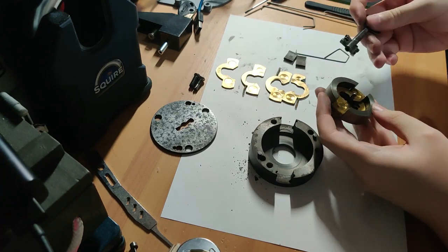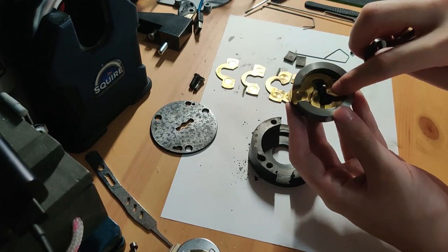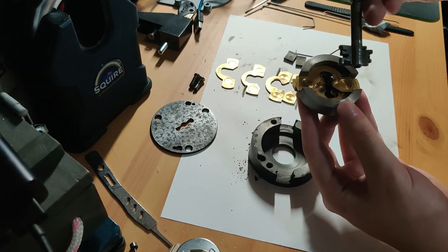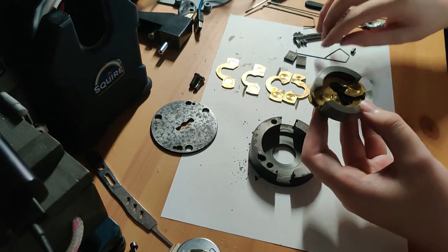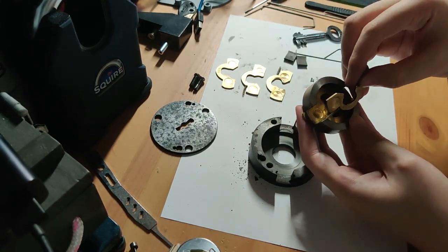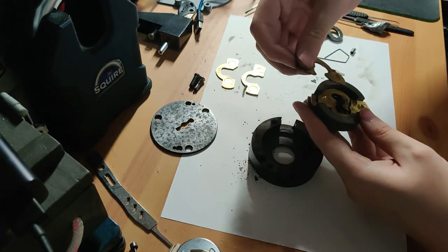Yep. Something to note, by the way, is a very unique feature. See how the back one is a bit that juts into the keyway? The key has a cutout there that interfaces with that. So a normal key blank will not be able to go into the keyway. That's just a feature of Kromer protectors. That can be in varied locations and whatnot. It's very effective.